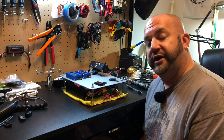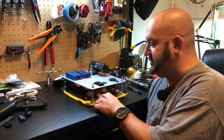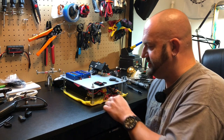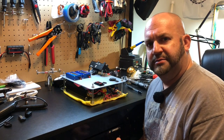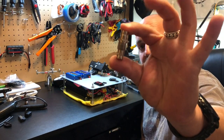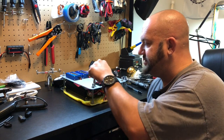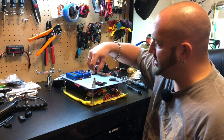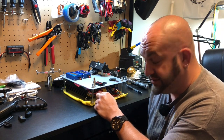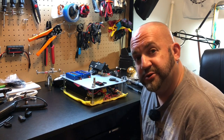Lastly was coax. I was thinking of drilling through the side of the box, but then I realized if I have a bulkhead in here I can't put this in — I'd have to drill out this, and I kind of liked the idea of just keeping the box completely sealed. So I have one of these barrel connectors for BNC, and I'm going to screw it right there on the top so I can just plug an antenna in when I open the box. I have just the right amount of room in there to make it happen.